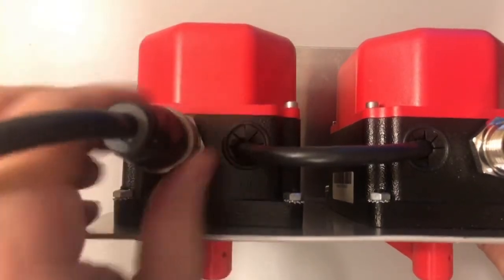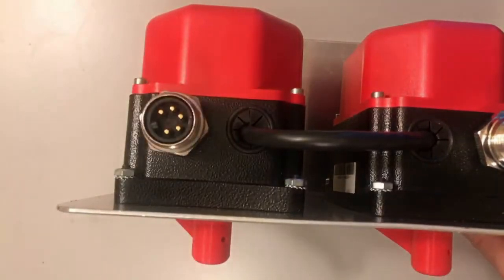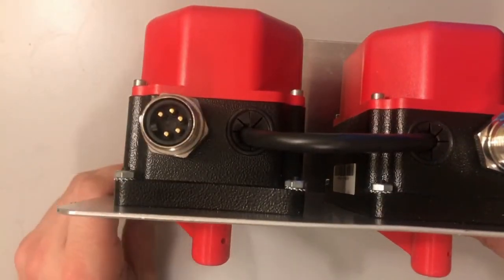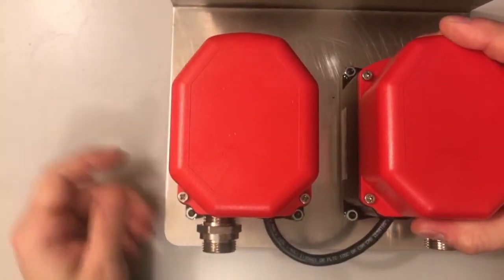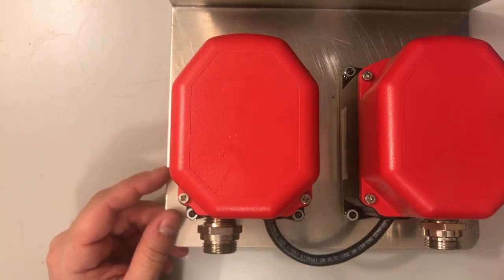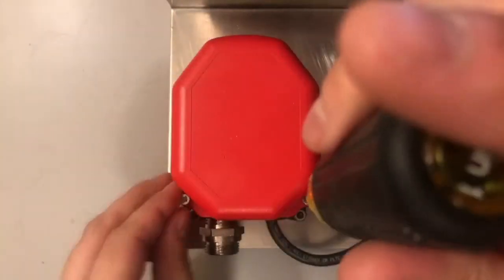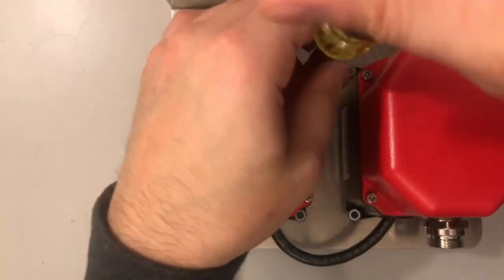Next I'm going to remove this. We're going to take the cover off one of the backs so we can access the couple of settings this has, such as the Modbus address. These servos use Modbus to communicate to the NXF4000 or PPC4000 on the bus. We also have the ability to move the servos manually using a couple of push buttons, and that's a great way to set your positions during commissioning. So I'm going to remove the cover and we can set the address.